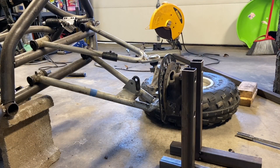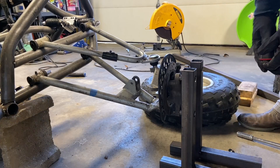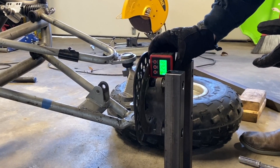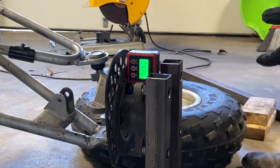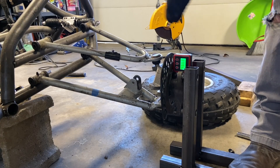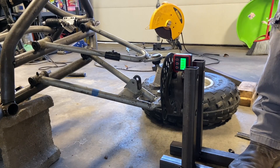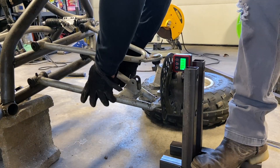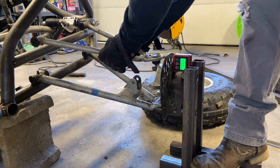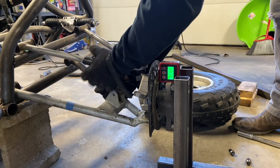As you hopefully saw on the time lapse, I just took those spacers I made and put them on the back side so it's nice and level. Let's see how we did - check it on the brake rotor because that's going to give you your definite angle. 89.2, and if we put some weight out here we're at 89.94 degrees - almost a perfect 90. If anything it's cambered in at just 0.05 degrees. That's awesome. Look at how much manipulation and alignment we have for when we make our tabs - this is a total win, we can position this wherever we want.